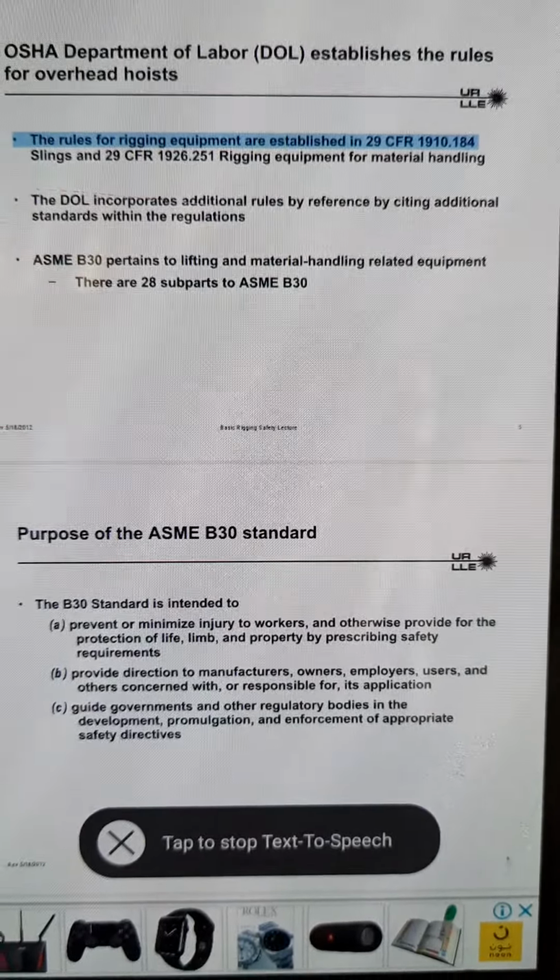Shoulder nut eye bolt installation for inline and angular loading. A. The threaded shank must protrude through the load sufficiently to allow full engagement of the nut. B. If the eye bolt protrudes so far through the load that the nut cannot be tightened securely against the load, use properly sized washers to take up the excess space between the nut and the load. C. Place washers or spacers between nut and load so that when the nut is tightened securely, the shoulder is secured flush against the load surface. D. Thickness of spacers must exceed the distance between the bottom of the load and the last thread of the eye bolt.